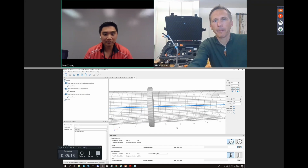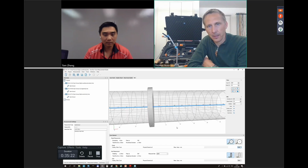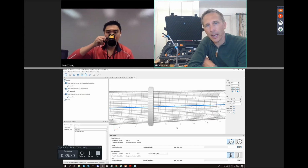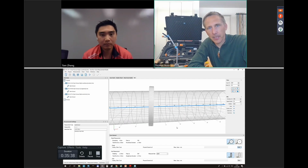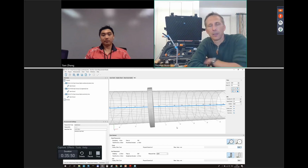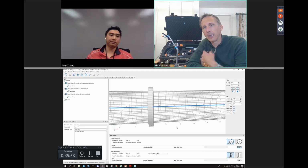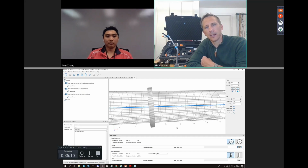That's pretty cool. And this is especially interesting when we have the shell runout as well. Then we see the wobble of the girth gear together with the tire and with the shell, how they are correlating. I will show you in a later session when we talk about shell deformation measurement with the laser. Then I can show you how they can be linked together. Because usually the gear was installed properly straight in the beginning, but afterwards something happened to the kiln and then the runout got affected. And usually it gets affected by deformation when the shell gets overheated. So then we struggle at the end with the gear runout.